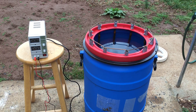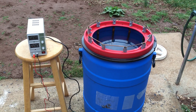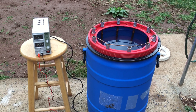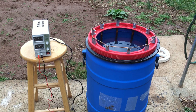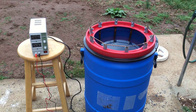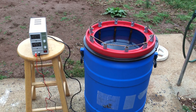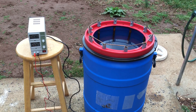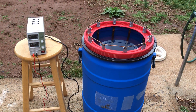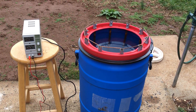On the left you'll see a DC power supply that allows me to both adjust the voltage and the amperage. I know a lot of people have been using car battery chargers in their de-rusting setups, but I didn't want to go that route. For essentially about the same money as a medium-priced car charger, I wanted one where I could actually dial in the voltage and the amperage and experiment with what works. This one does a really good job — I paid about $40 on eBay.